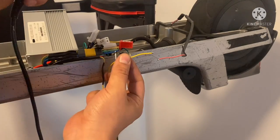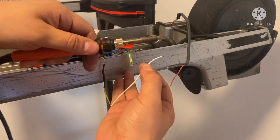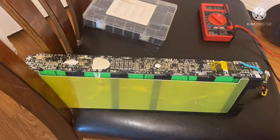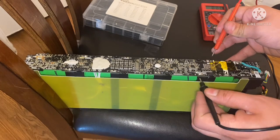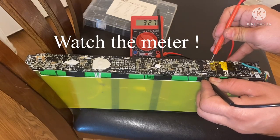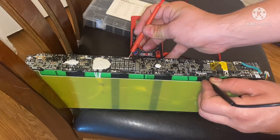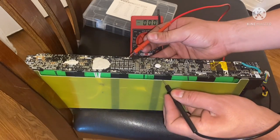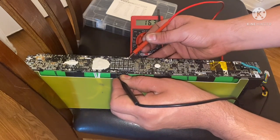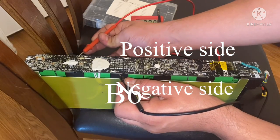Since I'm low on wire, my color code is going to be: yellow with red as my positive, white with black as my negative. Go ahead and cover those up. To get my backlight to function without using a step-down converter, I'm testing all my probes with my meter. If I check here and here, I come out with 32 volts. Moving my red over, it goes down to 28. Moving it down closer, it goes even lower — to 20. Move this black down here: 16 volts. Move this red down to B6: I have 12.2 volts. So I'm going to use B3 and B6.